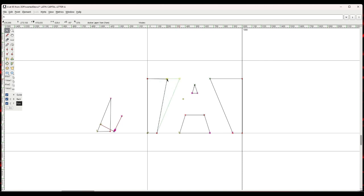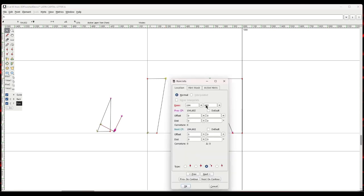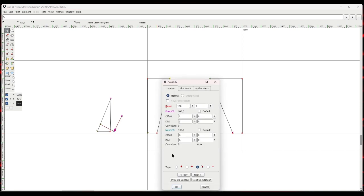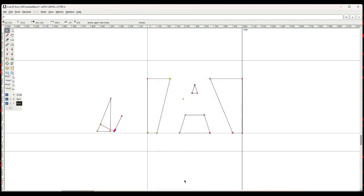I'm going to move this. That has to be 600, and then this is 100, I'll call it 200 and 40. Yeah, 240 looks good to me. So if I get 240 and 600, plugging this into my calculator, I've got the sine of the arctangent of 600 over 240 minus 100, because I know that this coordinate is 100. And I get that.